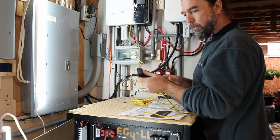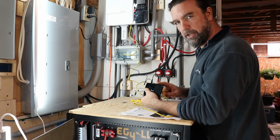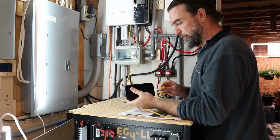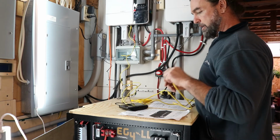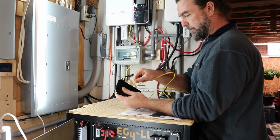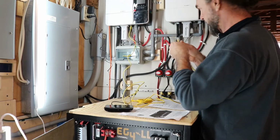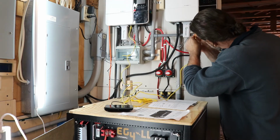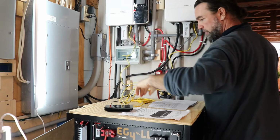Like I say, there's not a port 1 or 2 or 3. There's not a main. There's not an internet Wi-Fi connection in. This is just a bridge, so you should be able to connect them anywhere. Connect the number 2 patch cable that's going to go to the inverter number 2. We'll come up, we'll connect this patch cable to this inverter. Make sure that it is in the RS-485 port. Make sure that it's nice and secure. You should hear a click, and you do.